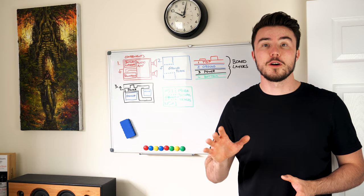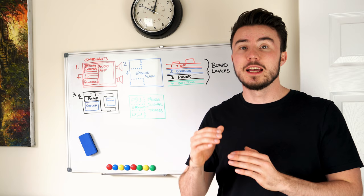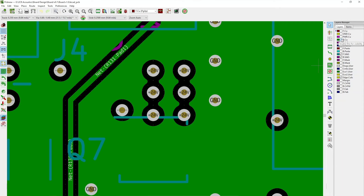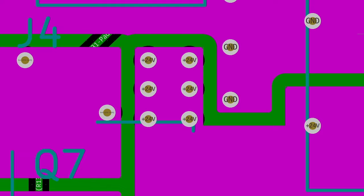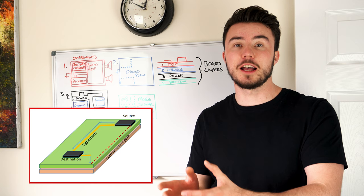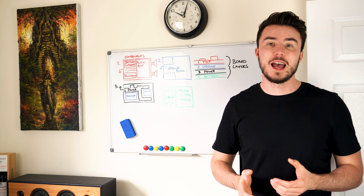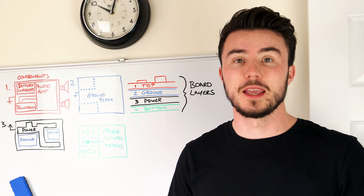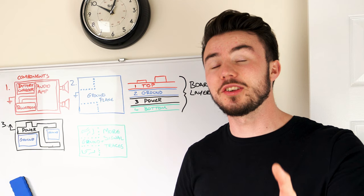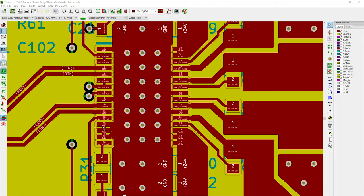For example, if you have a 5V plane on the top layer you wish to connect to the power layer on the third, but the second layer is the ground plane, then the via will connect those two 5V planes but create a gap around the via on the second layer so it doesn't connect. When designing your amplifier layout it's important to think about everything in terms of current paths. When you run power to a component, the current has to return to master ground — the ground terminal where your power adapter or battery connects — so you want to take the most direct unobstructed route back to reduce noise and lower impedance. This is why solid ground planes are a good idea, as they essentially act as a star ground where current can return in a straight line back to the ground terminal. Wherever I have an IC there are lots of vias underneath immediately connecting it to the ground plane.